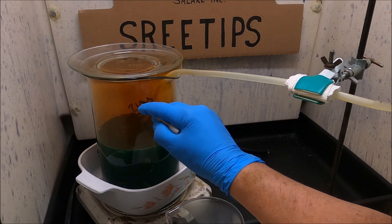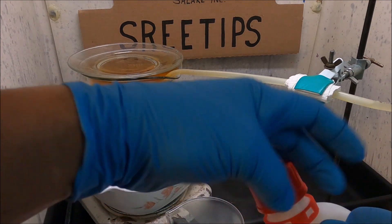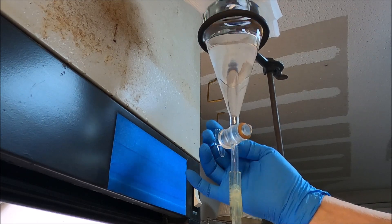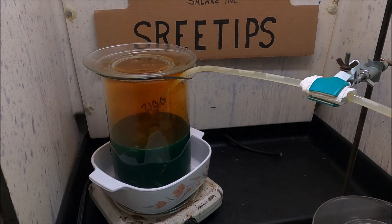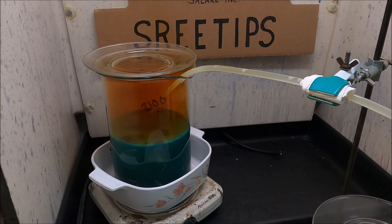I'm going to add another 500, and I'm going to keep going with this until we get all the base metals dissolved out of there so we can recover the foils. I'm dripping the acid in a little faster now — we can do that now that some of the base metals have been removed. It's not so important to add it in real slow. You can see that by adding it quicker it does foam up pretty good, but as the base metals get consumed, we can start adding the acid a little quicker because there's not as much metal in there to react with the fresh acid.